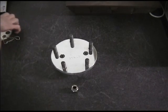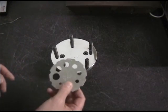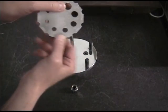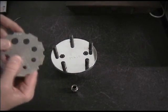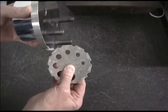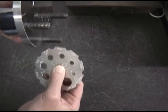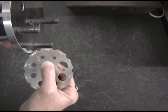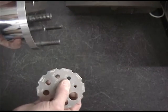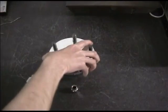There's another way to do it. You can purchase one of these — this happens to be from the Thexton Corporation — and this is a way to measure the stud diameter. That's too big, that's too small — pretty straightforward. When we look at it, we see that's a half-inch. Then we need to know what the thread pitch is, so we put our thread gauge up and check. Okay, that doesn't fit just right, and that definitely doesn't fit. That's a little better. And that's a perfect fit. Just to check the other side — of course, it doesn't fit. So the teeth drop into the grooves perfectly, and we see it's 20 threads per inch. We know it's a half-inch right-hand 20. So there are two methods to use for that process.